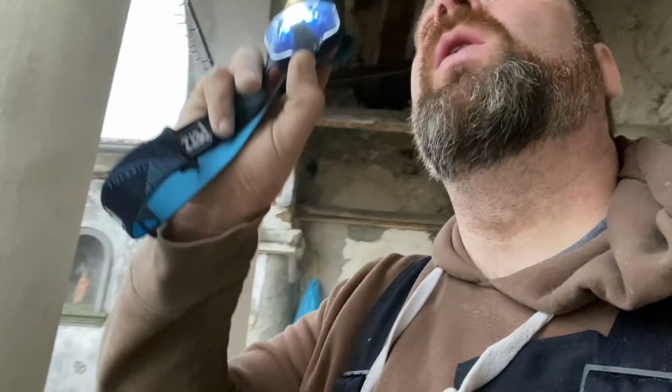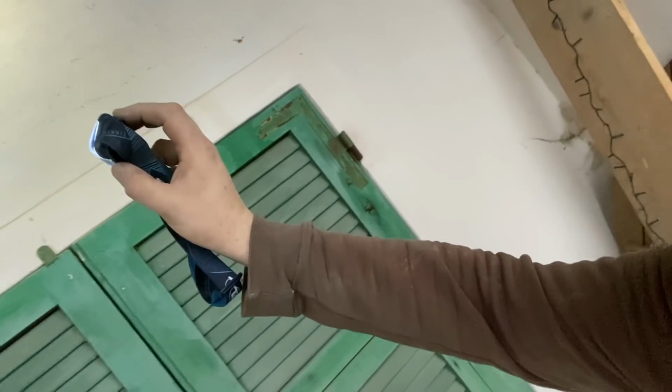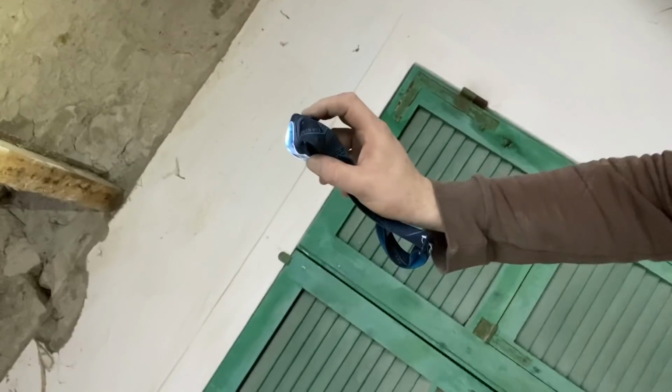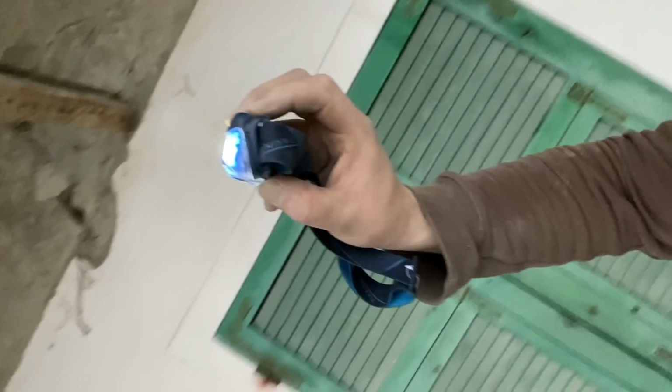I want to get them all set up and ready for wiring, so that tomorrow I can just go up and put the pipes across. Take these nails out, definitely keeping the metalwork. It was just a question of how much of the woodwork we keep, because the woodwork's there to hold the ceiling up, but the metalwork is to stop this wall from pushing out from those beams there.